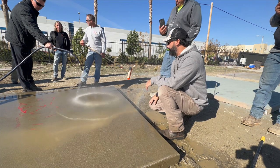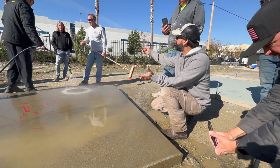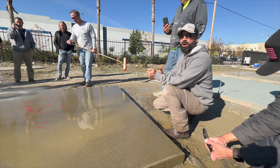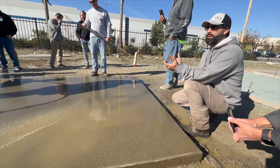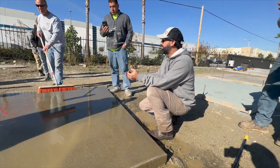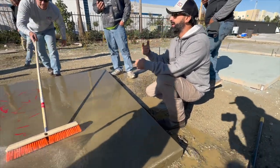On these sand finishes, if you don't get all the paste off and you come back here and put an acrylic sealer on here, it's going to stick out like a sore thumb - you'll see that paste on there. So do a good job of cleaning. That's where the floor scrubber and the swing buffer come in. If I'm coming back the next day, that's my best friend, because you're going to take the aggregates and use your advantage to clean this.